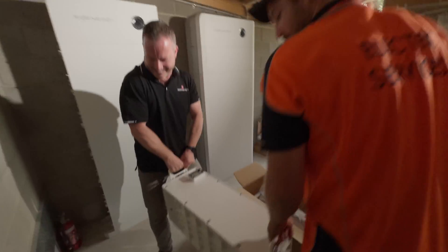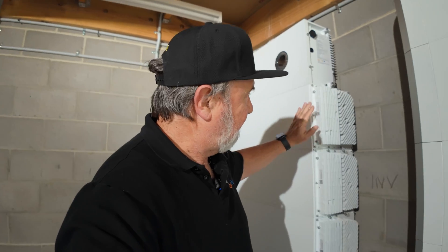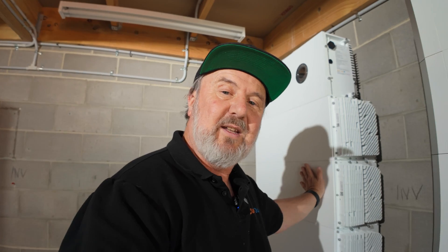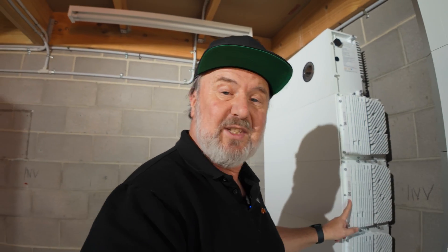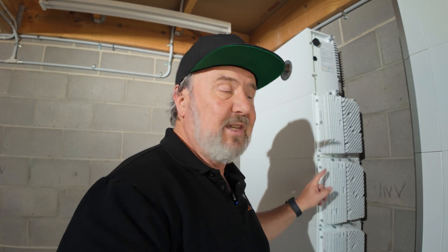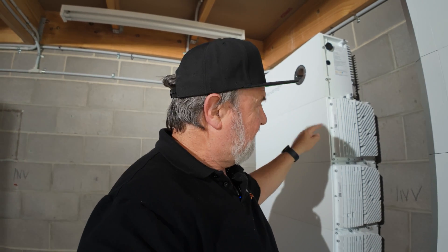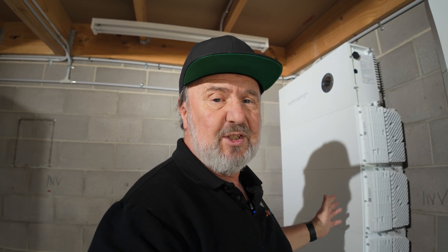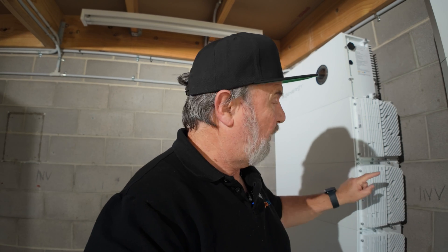These things are just like Lego. Each one is eight kilowatt hours, and this big heat sink on the side hides a secret weapon — these are actually roughly 30-volt batteries inside with a DC-DC converter that steps the voltage up to what the inverter bus needs, around 600 volts, so it's working at maximum efficiency. That means each battery can be a different age or different size, but they're all charged and discharged to their full capacity because of the DC-DC converter. That is a winning design.